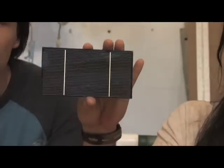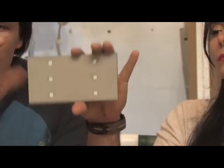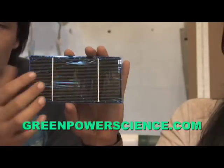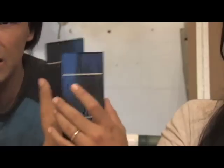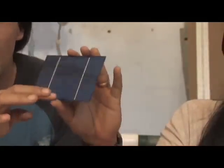When you get your cells, they usually come in a bundle like this, and as I said, they are extremely fragile. What you're going to notice with these cells is that there's a series of small white lines and two big lines — this is where your tabbing wire goes. On the back side, there are also six little joints where you solder the tabbing wire to. Most solar cells like this are usually negative on the front and positive on the back. So in theory you could stack them like batteries to build up the voltage, but only one cell would get the sunlight, so you can't do that. What you end up doing is running tabbing wire down the length of the cell, leaving some extra, and the next cell attaches to the back of the next cell — you tab them together like this in long chains.